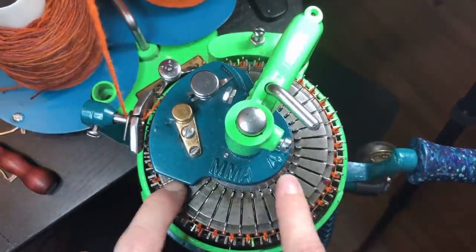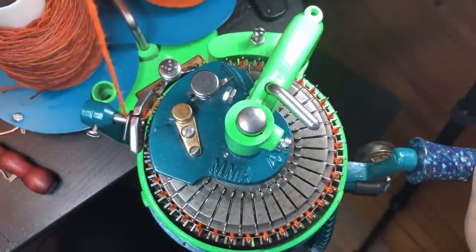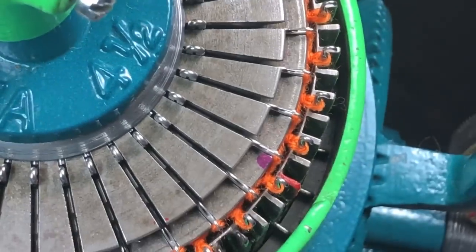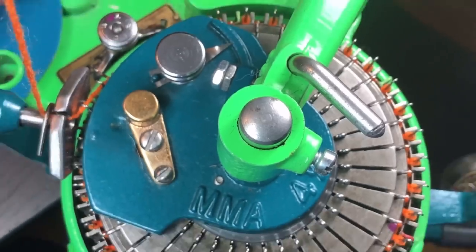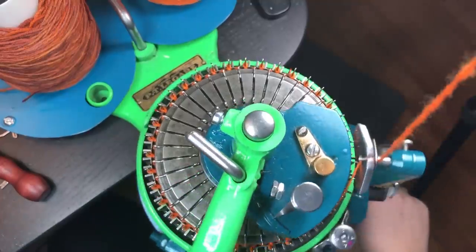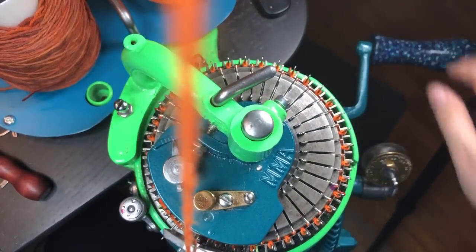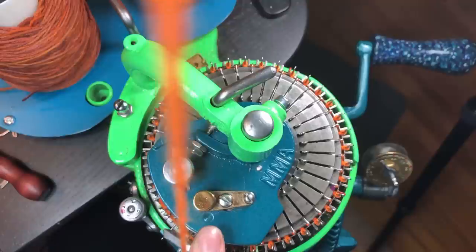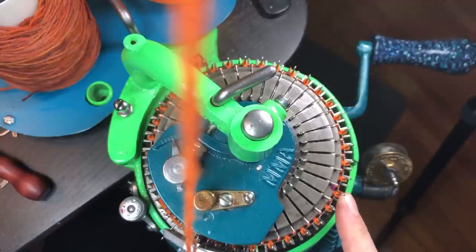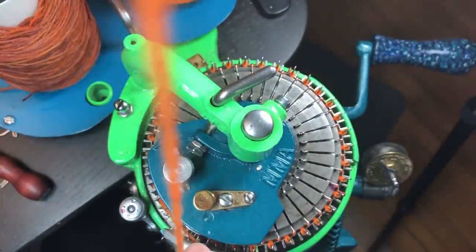I like to make sure all the cylinder needles are open and latches are open. You may look at this and say the latches are closed, but that's okay — when we cranked ahead it made the stitch and did what it's supposed to. We're just going to go around — I like to do at least two rows and make sure everything is happy. This is our six o'clock position for reference, and this is our three o'clock position. A lot happens here — whenever we raise or lower back needles for a toe or heel, that's done when the yarn carrier is at six.